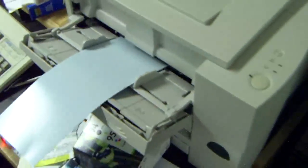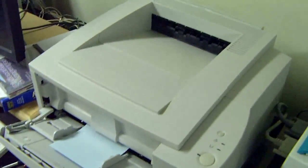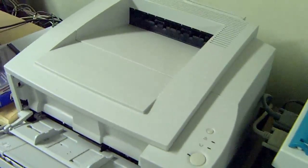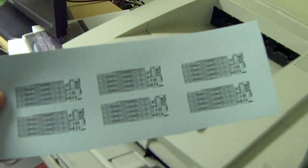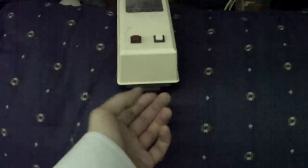So I'm printing now. And so the toner sits on top of the toner transfer paper, and it's like little plastic, and I can transfer that directly to the circuit board. Yay! See, it has my image just flipped back around.